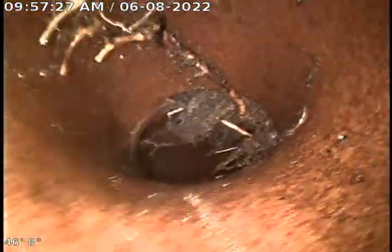Here we are at the city sewer. It's about almost 50 feet out from the basement clean out that we're working from. There's some roots right there but it's actually cracking the main, so we didn't want to jet any further and cause any damages. You can see right there a big long crack, but the root is actually following it.